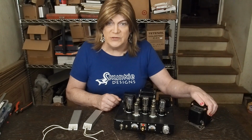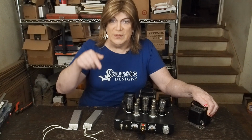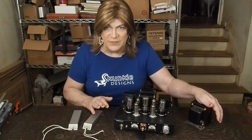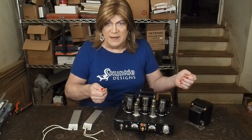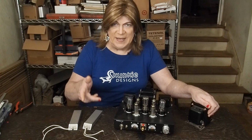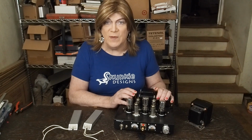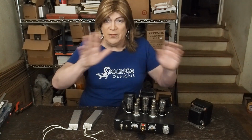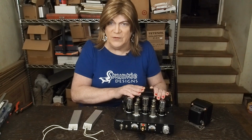There's plenty of videos and content. I'll try to find a website to put in the description down below that goes into more detail about how to make sure you're getting one of these. But if you have one, you don't have to worry about getting the grounds crossed up with a hot and burning up your oscilloscope. You could be testing an amplifier that has been wired up wrong, or was maybe wired wrong from the factory with the hot and the neutral reversed, or some other mess, if you don't have the neutral isolated from the ground.